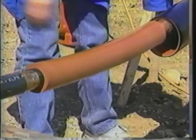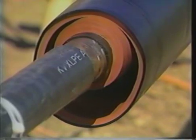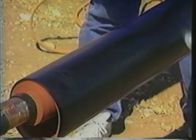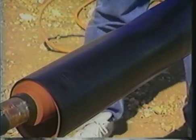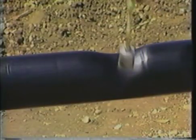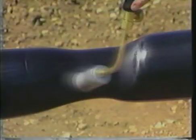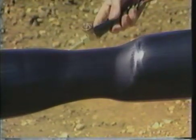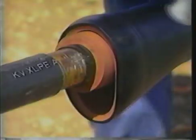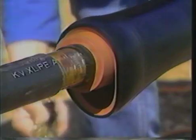The second dual wall elastomeric component allows the electrical screen of the joint to be installed together with the final insulating layer. In this case the outer layer is of a black heat shrinkable polymer with conductivity close to that of the cable screen itself. Ease of installation accompanies reliability. The heat shrinkable properties of the components do not rely on the circumstances of installation. The result is a pre-engineered cable splice.